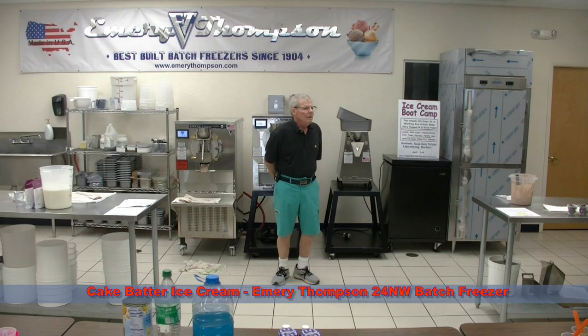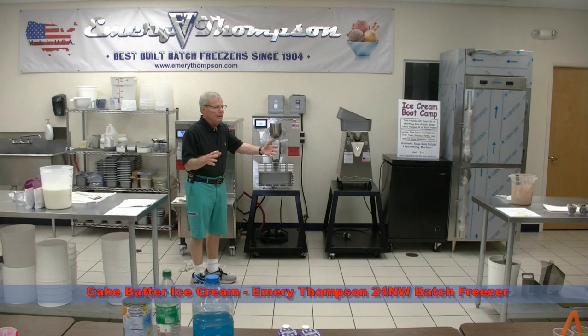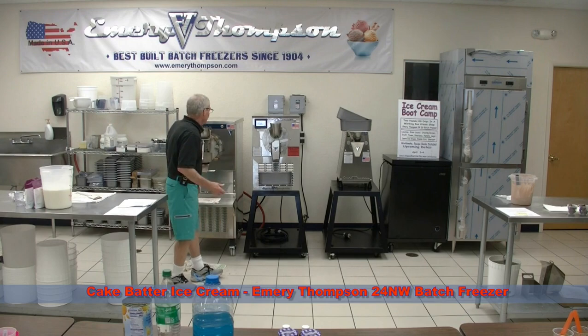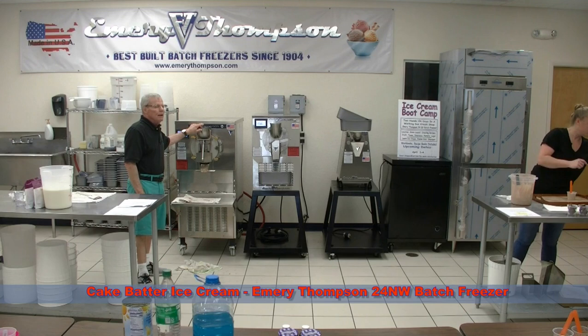Italian ice has very little air in it. We make on all the machines full batches based on the bags. The bags are 2.5 gallons of mix, so with the air, that's 5 gallons of ice cream, 20 quarts. The machine can make, and will make for you, 24 quarts of ice cream. But you would have to pour in a whole bag and now measure out two more quarts. And that's going to throw all your recipes off, and it's a pain in the neck. So in ice cream, I do 20 quarts finish capacity.